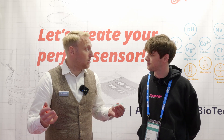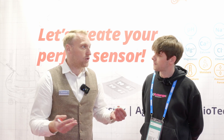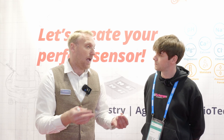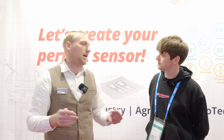If you want to integrate one of these into your design — this is not a usual component you'd put through a reflow oven — you start with a design tool like Altium or other software, design your routing and layout, and bring the open pad to the position where you want your pH sensor, sodium sensor, or temperature sensor placed. Then you go to a screen printer or PCB printer and create your layout. You take our stickers, peel them off the adhesive, stick them, and you're ready. The sticker provides mechanical fixation, mechanical attachment, and also the electrical connection, because we have an electro-conductive tape integrated. No soldering, welding, or gluing process needed.